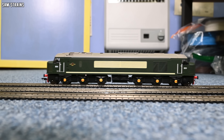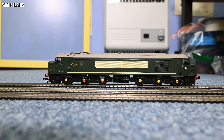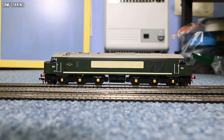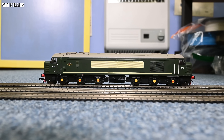Running in is complete and I'm not too sure where to stand on this. In some ways it was a good experience — the loco never derailed and the unusual leading and trailing axle design caused absolutely no issue. However, the curve problem is still there — it was slowing down on basically every curve on the layout and seemed to be getting worse over time. It has also started making a metal scraping noise when it reaches curves.